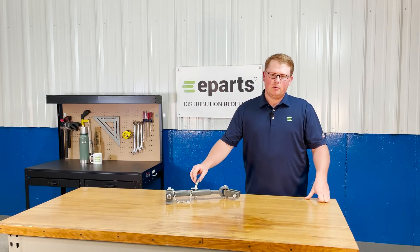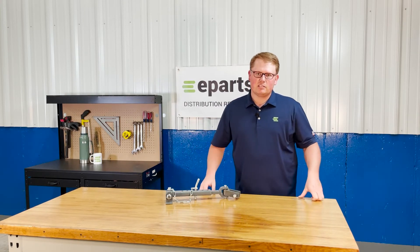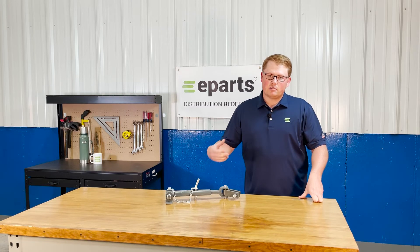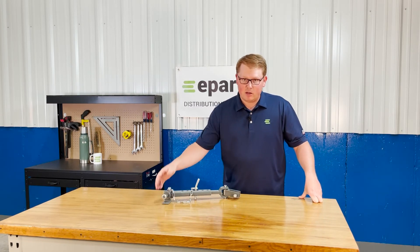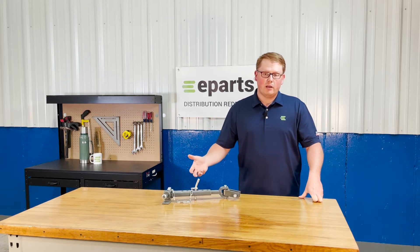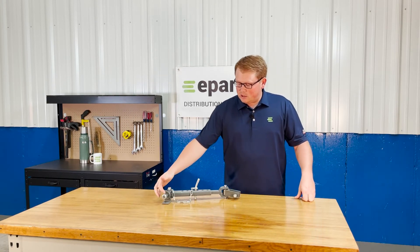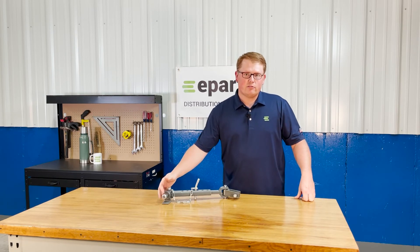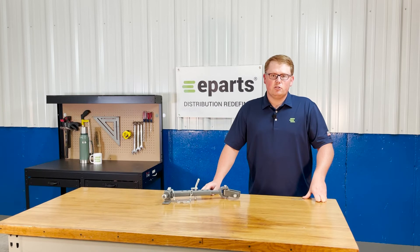You want to make sure to keep this pin in place while you're using your machine. If this isn't in place and the stabilizer is sliding around, that causes a lot of pressure on both ends. It's also very common, if that's happening or if you're using too big of an implement on the back of your tractor and hitting something, for this pin here to shear off. So just make sure that you have all that in place and you should be good to go.